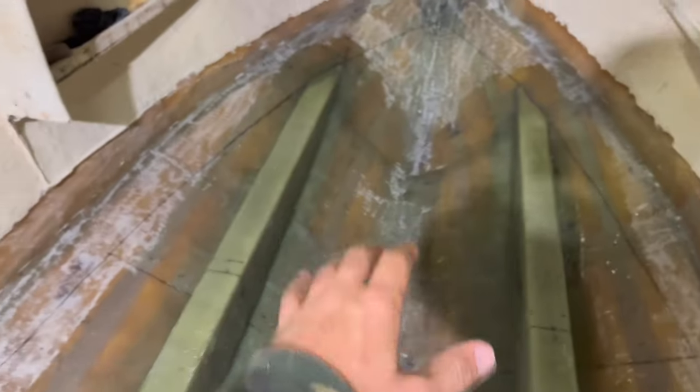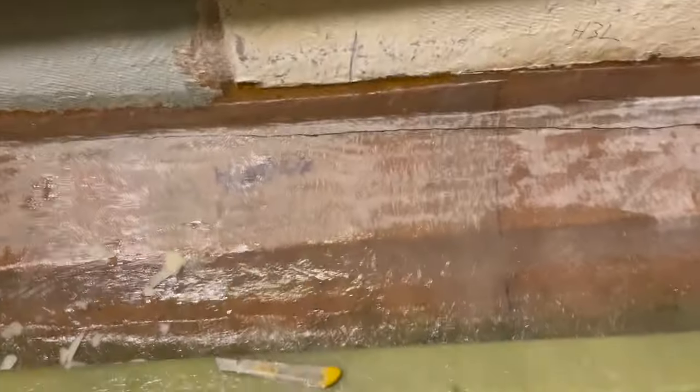Obviously there's going to be a little bit of structure through here because the floor is going to go all the way through and then to the other side there. Now this floor is going to be completely sealed — no hatches, no live tanks, nothing. Full 100% sealed with foam on the sides. It's literally going to be from here to there, just to have a little bit of buoyancy there for safety reasons, but the main internal part is going to be through the bilge.